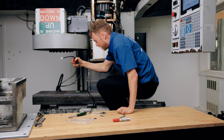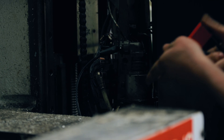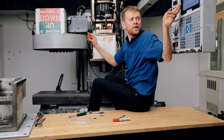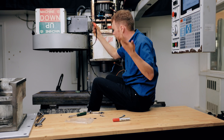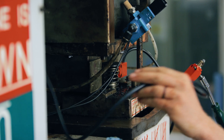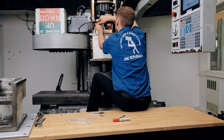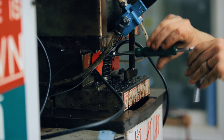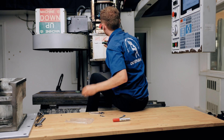The switch is out. I'm going to put the new one in — I always check new parts. Drawbar close is switching, so the new switch is good. I'm going to route the cable and wire tie it up. I'm going to tilt the switch up, get the first screw in, then turn it down and put the other screw in.